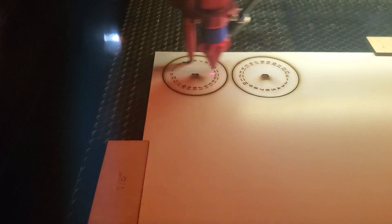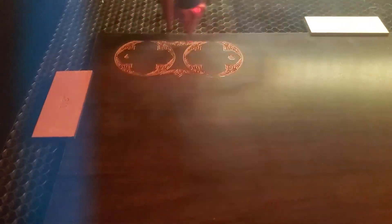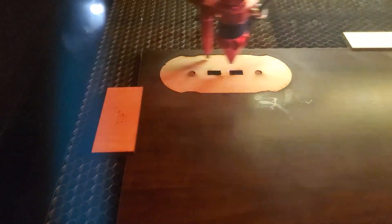Here I'm cutting the dials — you don't need to stop in the middle for this because it's all three straight steps. This is the laminate with a white top that works really well for the number dials and cleans up very easily. This is the faux ebony — only a possible choice for the top, but it's a beautiful one. It was one of the materials where a single cut through worked; several others required a second pass. When flipped, you can see it's actually light-colored wood on the back — the front is clear coated, but even the side cleaned up pretty easily.